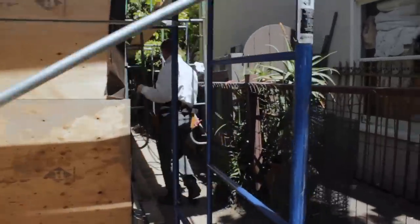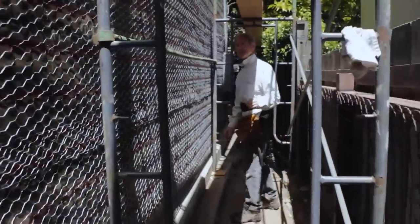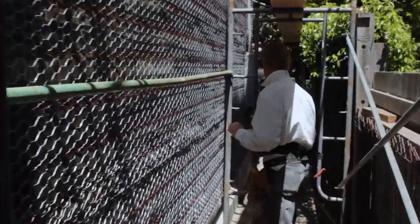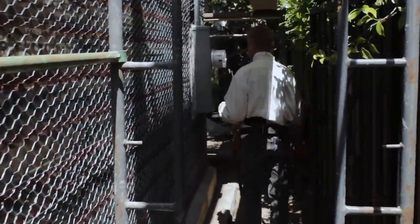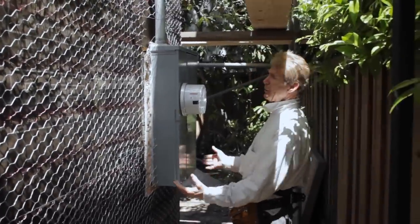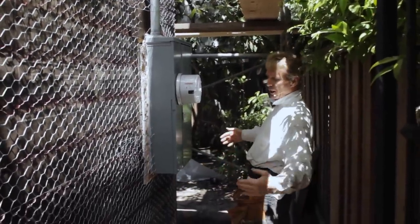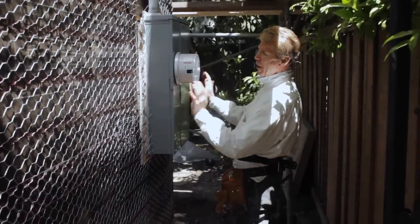We've gone ahead and waterproofed all these walls. That was the idea. Waterproof the walls so that they can come in and keep moving and get the insulation, all the sheetrock done. And yeah, we still got to do this electrical box. What they'll do is they'll remove this and we'll take our paper up and back and on top and then put a coat of stucco on there.